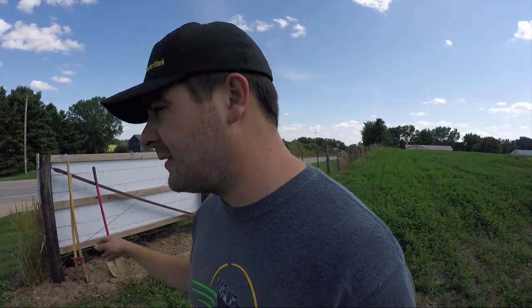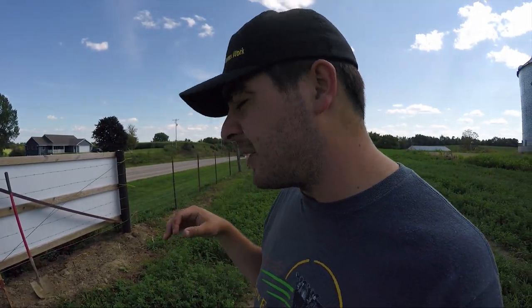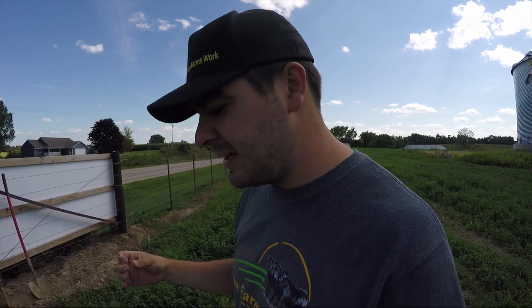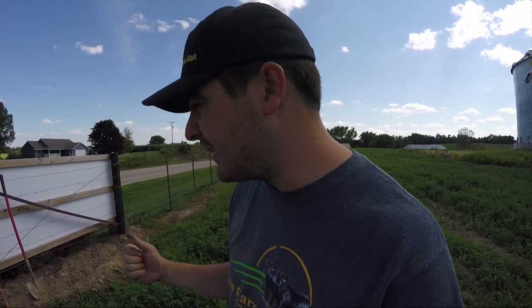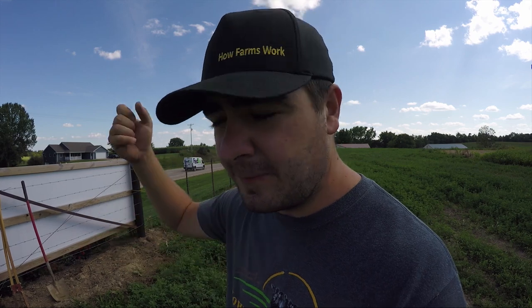So just for now, I think I'm going to put up a 20-foot flagpole. I got it in the house and I just have to dig the foundation for it. What you got to do is you got to put a base down of gravel and some sand, and then they give you a sleeve that you got to stick down the gravel, and you got to get it so it's nice and plumb. You got to throw concrete in there so that way it sets up and everything, and then it's nice and level, and then you start building your flagpole on top of it.